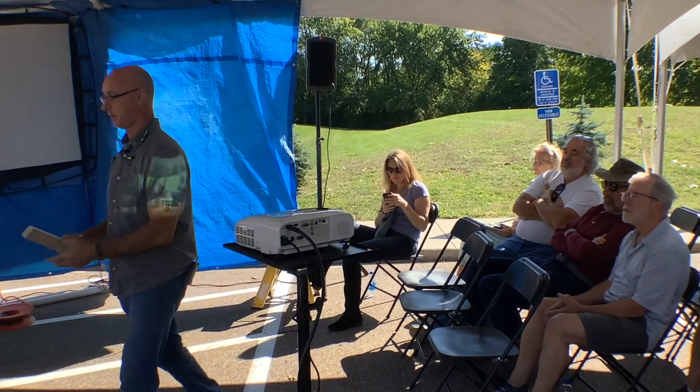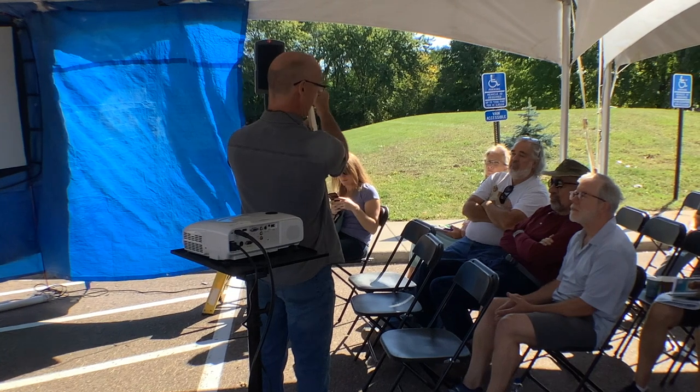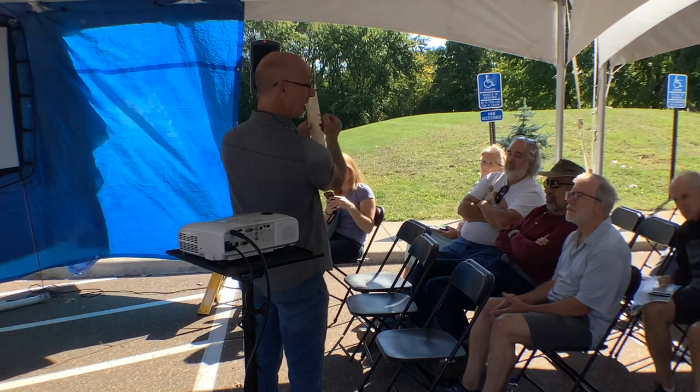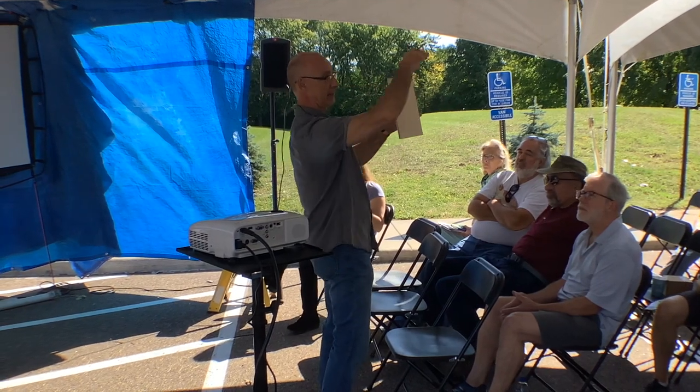So what you would do with this is you rip the straight grain stuff off the edges. These become your raised panel. You put the cathedral into the raised panel. That's where you want that uplift.